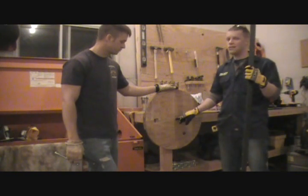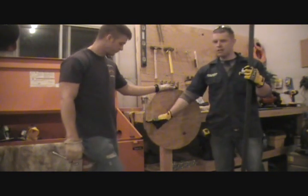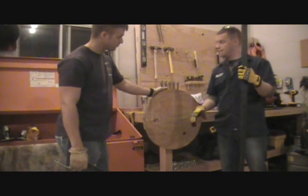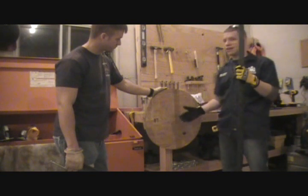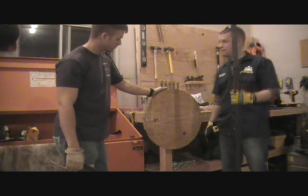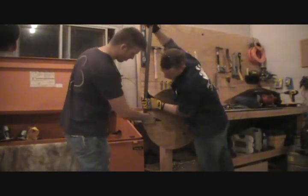It was square marks at first. We drove a screw right in the center, tied a piece of fishing line around it, and then tied the fishing line to a pencil and tightened it down to where it matched the line, and then used it to trace around. What we were actually doing was making a drafting compass, except a big scale one. Those can be really expensive, so sometimes you just have to think outside the box, use something like fishing line, and it works perfect. After we got that done, we made a notch right here, and that's going to hold our starting point with a C-clamp.